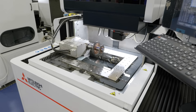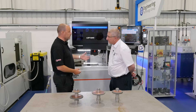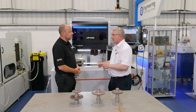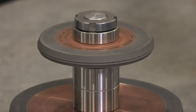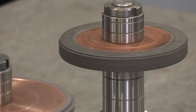With any solution there are always costs. Is it going to be more expensive to run this machine, to purchase it, the consumable element — is there any disadvantage? A lot of factors come together. You've got the cost of your dressers and the dirty, dusty process. But when you then start to look at savings on wheels and also the extra output you can get — and tool grinders are very expensive — the actual operating costs of the machine are very, very cheap.